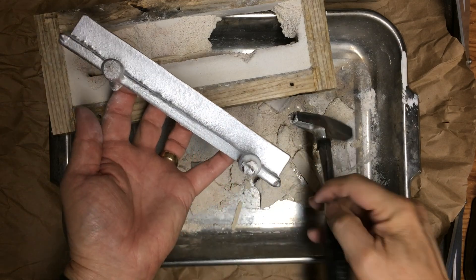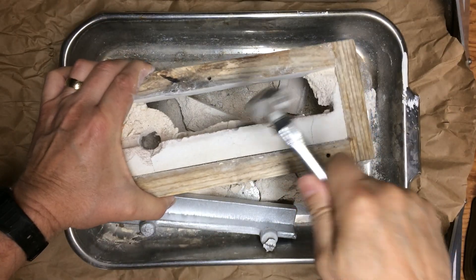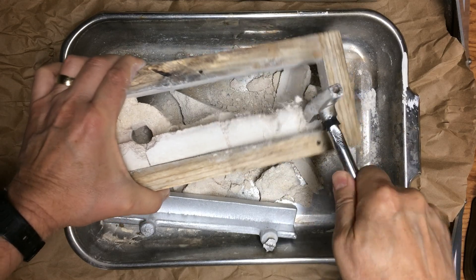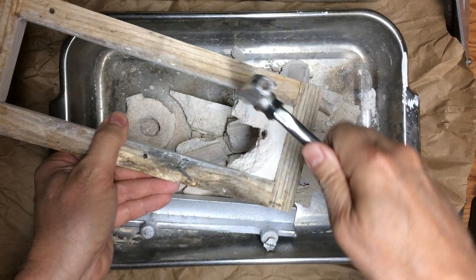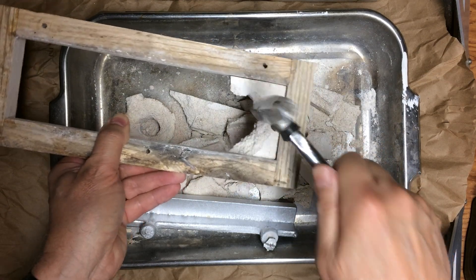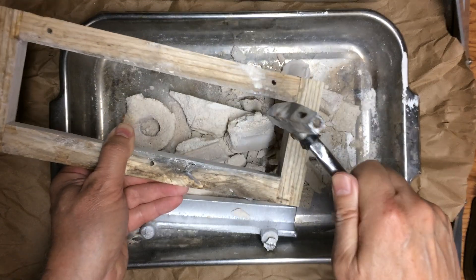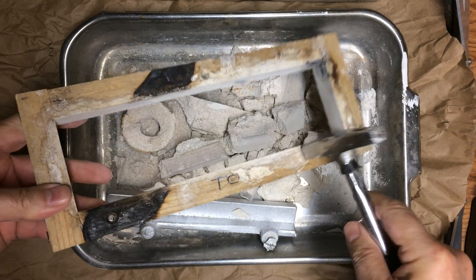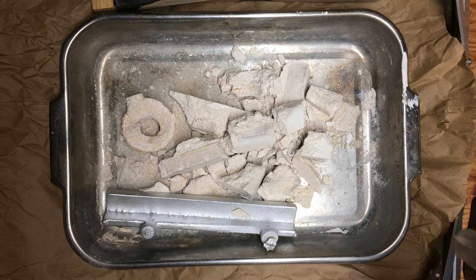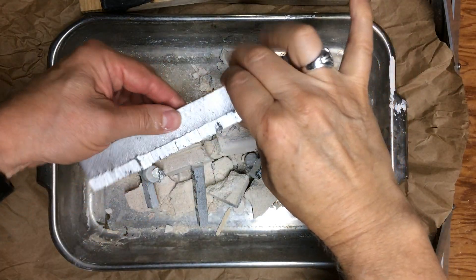Right out of the mold, it does have a little tone to it. I'm just going to tap the rest of this out of here. Now what we can do is grind that up with a mortar and pestle kind of arrangement, and if we re-bake it to 300 degrees it will reactivate the plaster and cause it to be able to bond again. This is a plaster sand mold — 50% plaster, 50% sand. A little magic with the bandsaw and we just chop off those three pieces there.